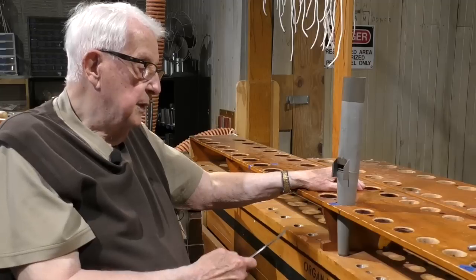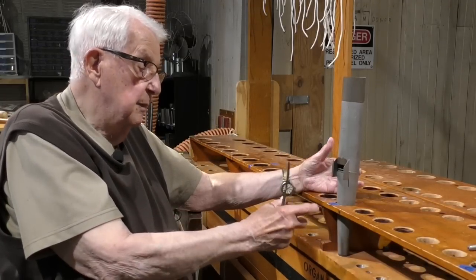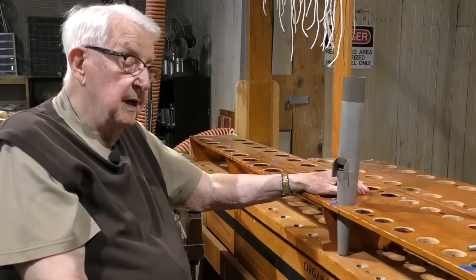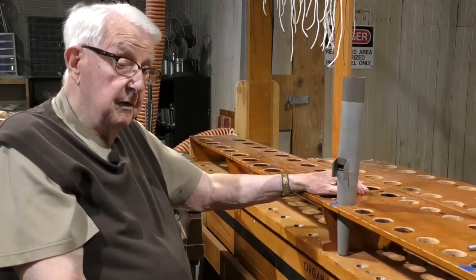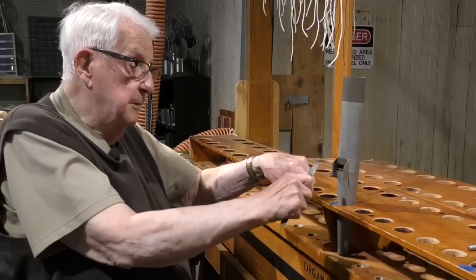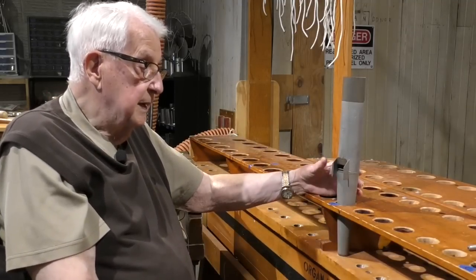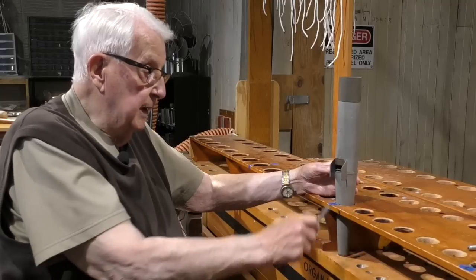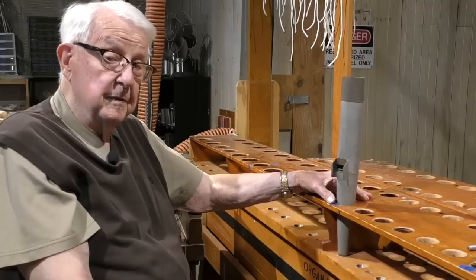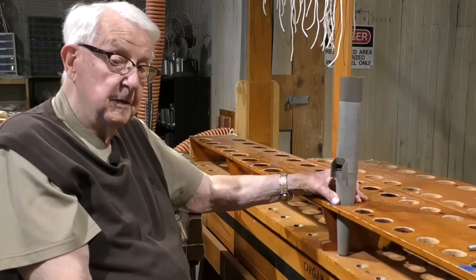There have been a few wood pipes in which the languid itself has gotten a ripple to it. Two of them had nothing in it at all, just a wood pipe trying to blow away, and it sounded like a foghorn. The minute we were able, by manipulation, to get something back in to perform that operation, it brought the pipe back to match its brothers. So it is a significant asset to tone.